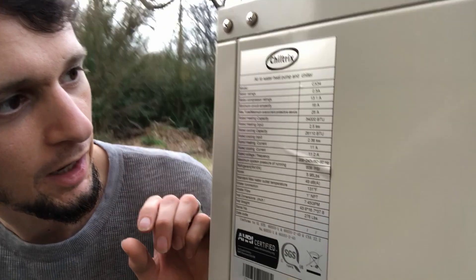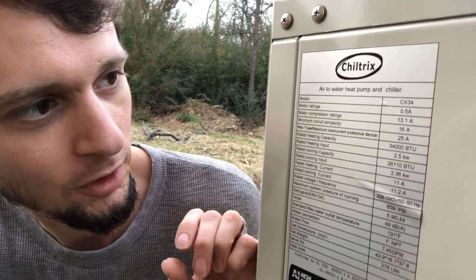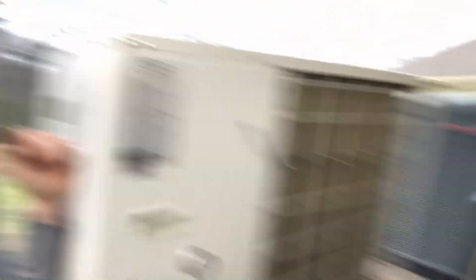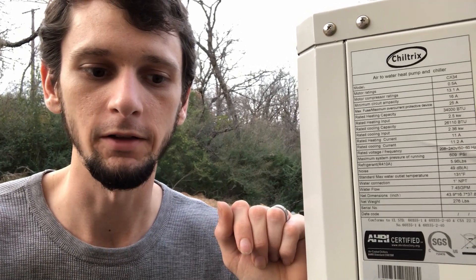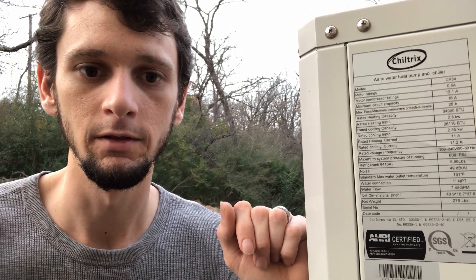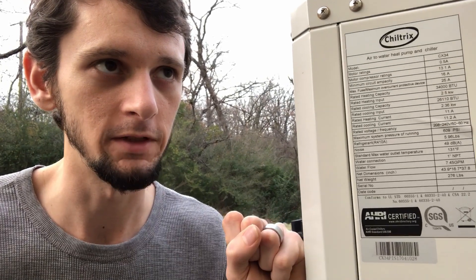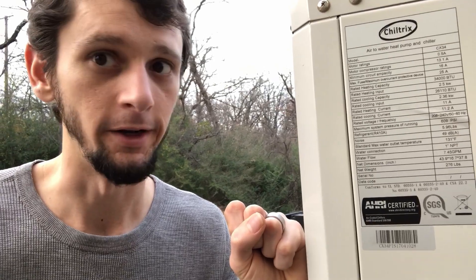You've got a heating capacity of 34,000 BTUs — that's almost three tons — and a cooling capacity of 26,000 BTUs. Another great advantage of these Chiltrix units is that they are slow-start. If you have an off-grid solar installation, you can actually run one of these much easier than a conventional AC unit that kicks on real hard, even with something like a 14,000-watt inverter. These use inverter drives that ramp from about 40 percent capacity up to 100 percent.